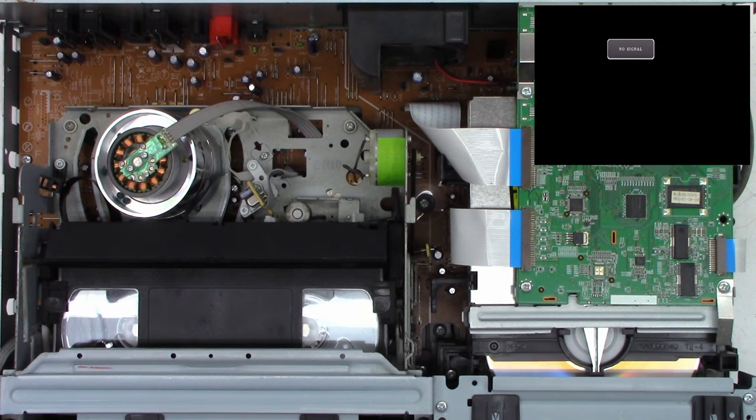I believe the problem is probably going to be the prism, which lives up here on the top of the unit right there. You can see how nasty that is. Let's go ahead and try to get focus on that. There we go. Look how dirty that is. So any dust that accumulates on the outside of this prism actually disperses the light or the infrared beam, so this will need to be completely cleaned. I want it bright and shiny when it goes back together.